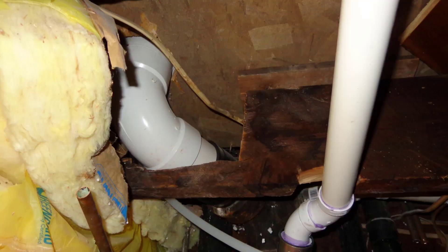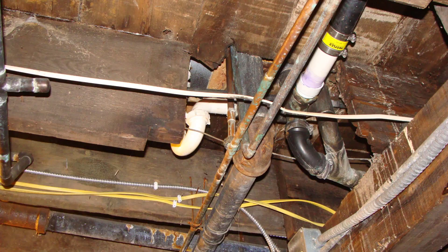What is a home inspector to do when we come across a floor joist that's over-notched or has a borehole that's too big? I'd say it's a judgment call. If you have a joist where someone just cut out the whole thing, call a carpenter in and tell them to fix it. If you've got a joist where the maximum size hole was supposed to be 3 and 3/4 inches and they got a 4 and 1/2 inch hole and it looks like somebody did this 30 years ago — who cares? I'm not going to make any big deal about it. But big holes, we'll call a carpenter to come in.